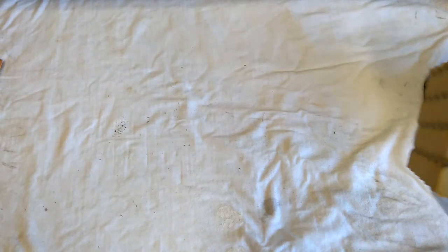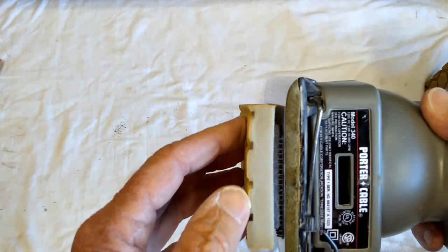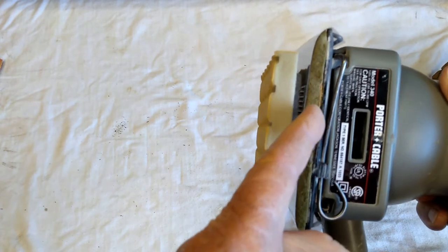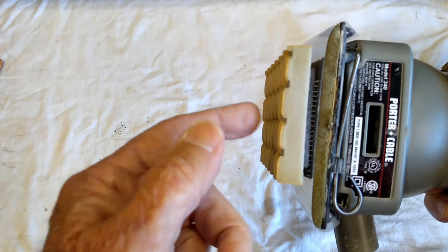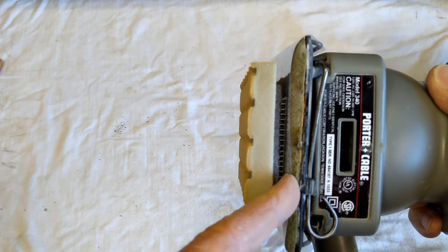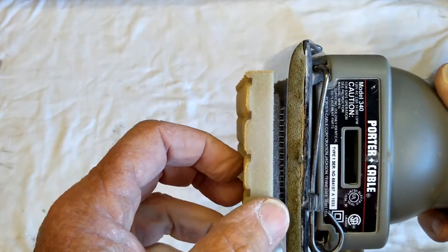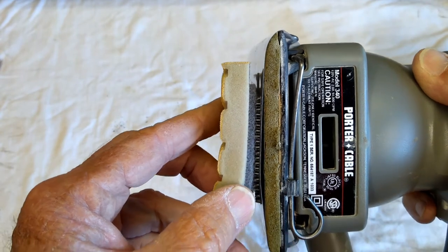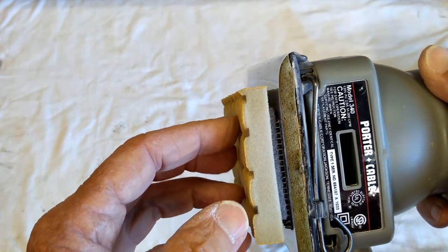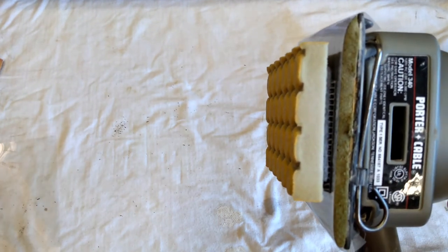What I did then — which you can do too so you don't mess up your own sander — is use a different one that has a slightly softer pad. But instead of attaching the velcro directly to this foam base, the foam base wouldn't flex the same way. With regular sandpaper on it, you just can't sand crenellated surfaces — you only get the tops. This lets you get down into the little grooves and crannies. I think that's actually where the word 'crannies' may have come from — crannies and crenulations.